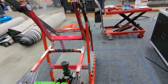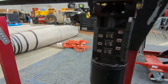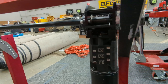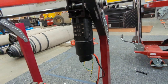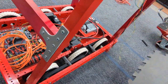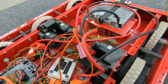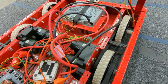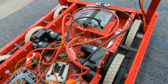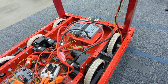We're going to hook the chain up to that. We got our Falcon with a stack of gears through a 90 degree, and that's going to control the in and out motion of that arm. This is the driving chassis. We have our brushless motors down there on the gearbox, and instead of having that stack of weights that the EveryBot had, we cut a solid steel belly pan, which itself weighs quite a bit — so hopefully that keeps our center of gravity low and allows us to do what we need to do with this machine.